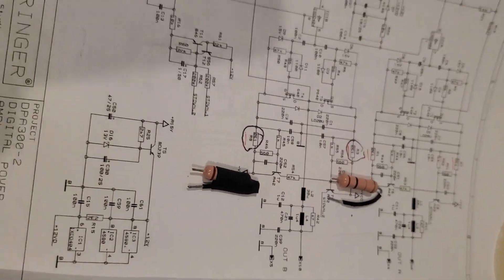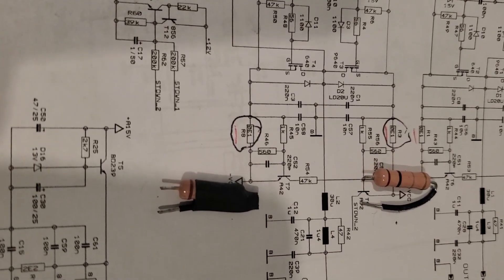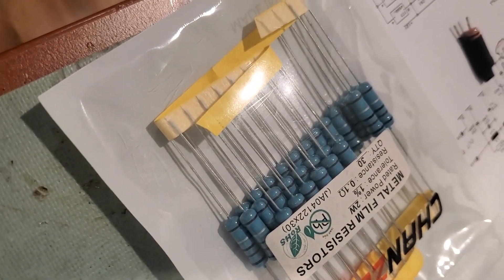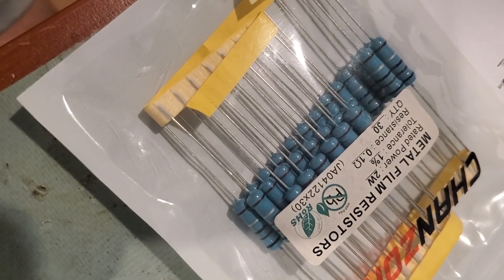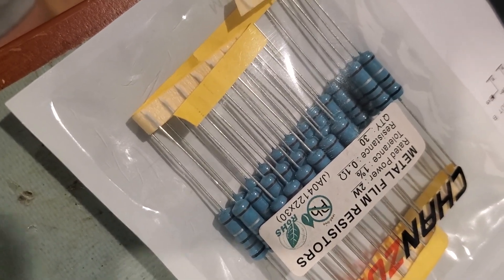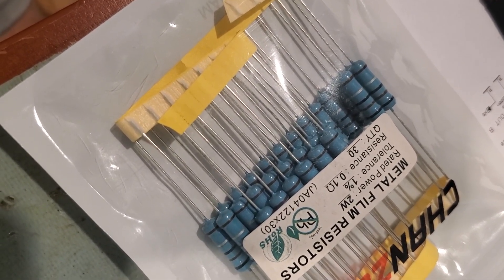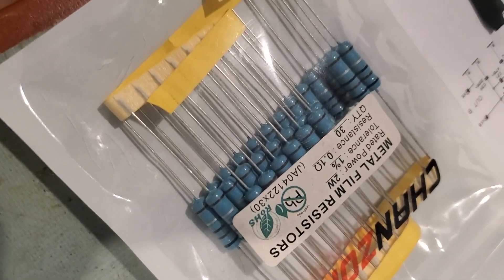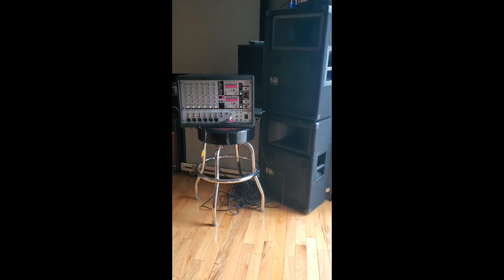Here are the blown resistors R3 and R8 that I replaced. I bought replacements on Amazon — available for six dollars for a 30-pack, pretty much the same size, so I assume these are 2-watt resistors. I considered using four in parallel to increase power capability, but I think it's better not to — you'd rather have these blow open than burn traces on the board. After running a series of tests, everything is working normally now and both channels work great.